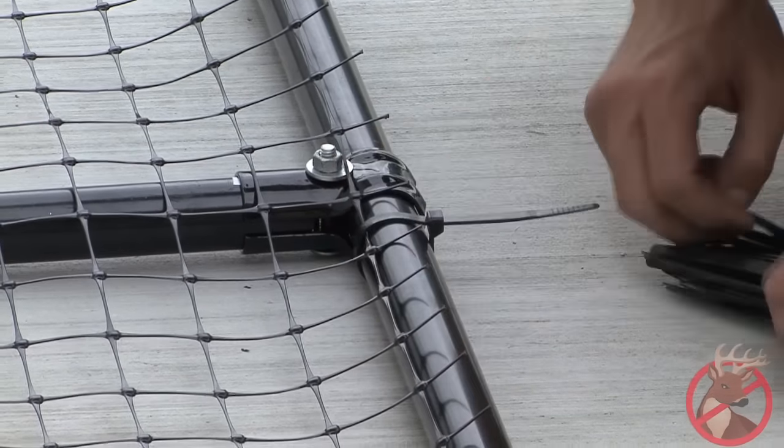If you are using the tension wire guide clamps on your corners and line posts, run the wire through the eye bolt then terminate at the end of your structure with a connection sleeve. To tighten your line, there are two ways to proceed. First is using a gripple. The gripple can be used to connect two separate pieces of tension wire. To tighten, use the gripple tightening tool. Insert each wire end into the holes on either side of the gripple. Lock the gripple into the tightener and open the tightener, then simply close the gripple tool to tighten the line. This should tighten the line; then cut off any excess wire.